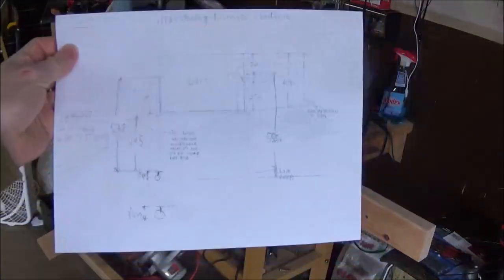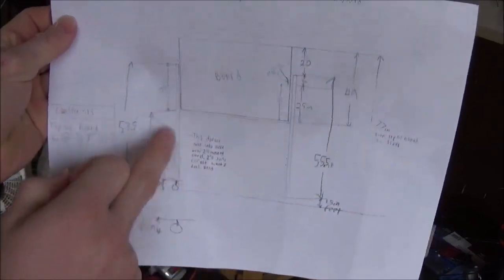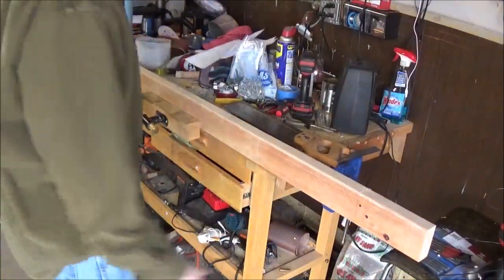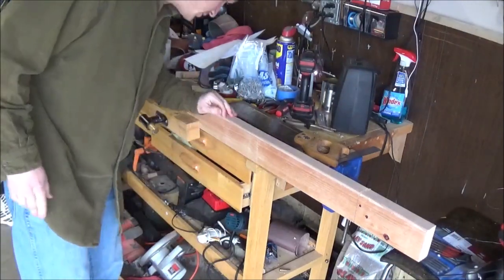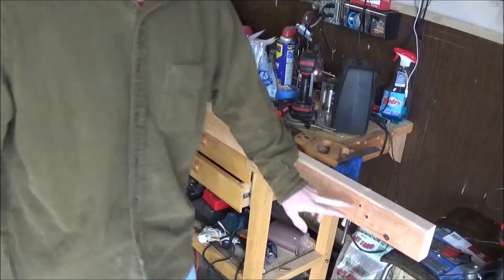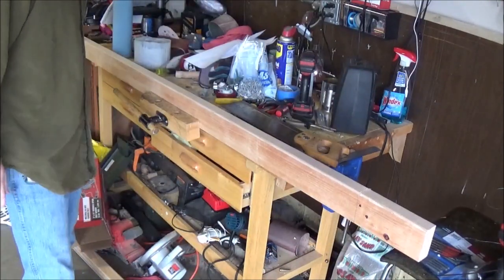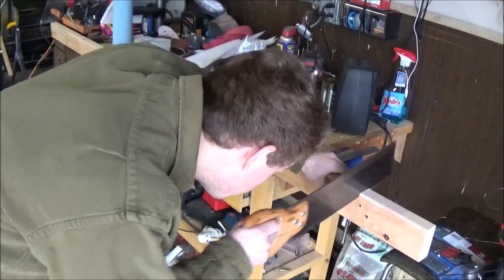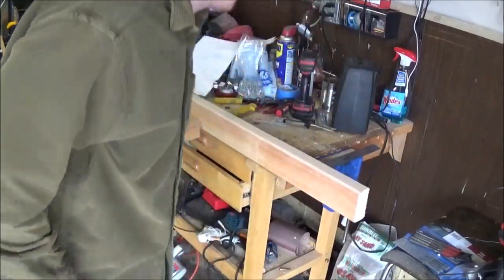I'm gonna start building the frame. Specifically, I'm gonna cut out these upright posts. I found a pretty clear piece of 2x4 at Lowe's. I'm gonna basically pick the cleanest part. I just need 57-ish inches, and we're gonna call it good. So I'm gonna lop off these knots, and then measure it out 57 inches. Cut the other end off, then rip it down the middle. Beautiful.